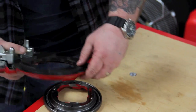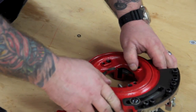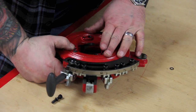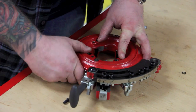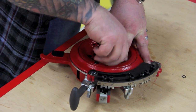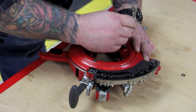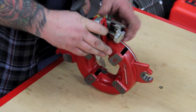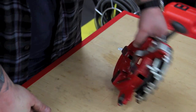This is probably the easiest way since these are machined together. Set that back down on top of there, then put this over here. Now rotate it so it fits in there — about a quarter of a turn — so you can feel pressure on it, and get one of these started back in. You should be able to feel tension on it so it rotates back. If it doesn't, then it means you didn't rotate it far enough. And that's it — how you take it apart and put it together.